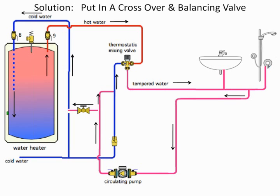The hot water going out was a 2-inch pipe. Now, quite frankly, I thought the recirc line was too big, but that's the way the engineer and contractor designed it. The bypass line from that inch and a half recirc line was 1/2 inch. So you can see it's a much smaller size pipe. And this allows us to balance out.